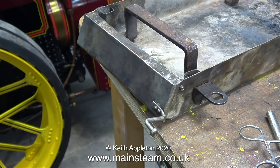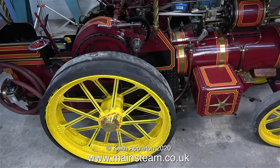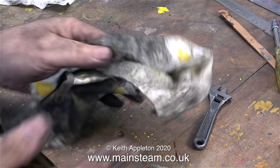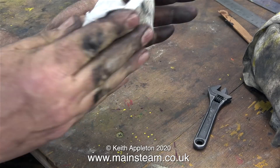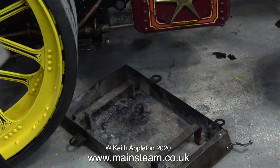That's a lot better — mechanically it's now solid. Now comes the difficult part; refitting this very heavy grate and ash pan to the engine, which means I have to support it underneath whilst laying on the ground, and it's far too heavy for one hand. I tried a couple of pieces of wood to support it but that didn't work. This was a very dirty job — look at the state of my hands and my arms. Then I had an idea: put the ash pan in first, just support it on one side, then slide the grate into position, then lift just one edge into the mountings for the other side. Quite simple when you think about it. The mechanism for holding the ash pan in place is quite clever — although both sides are fabricated from the same piece of metal, you can locate the ash pan one side at a time.